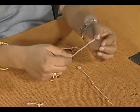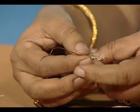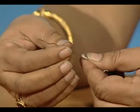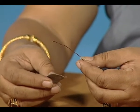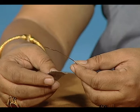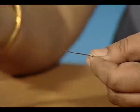The commonly used connecting wires in our labs are made of copper. Copper is expensive and we should not waste any, so cut the wire to the required length and use it in the circuit. The wire end has to be clean — the insulation, which is provided by just a thread on it, should be removed. The exposed portion should be straightened and cleaned with sandpaper. Copper develops some oxides on it, and because of that the connection may fail or it may change the value of resistance at the terminal point. So clean this section with sandpaper — just doing it two or three times is sufficient.